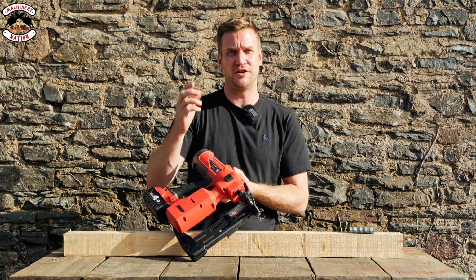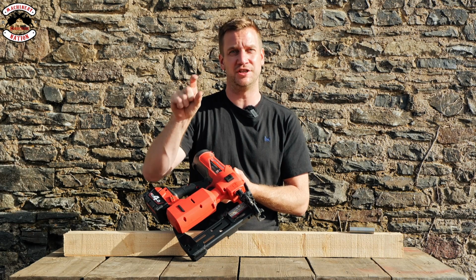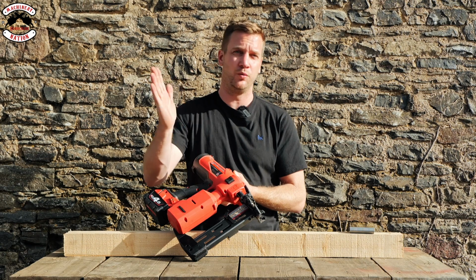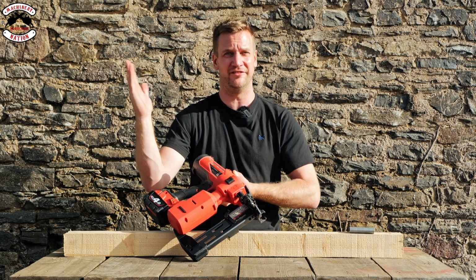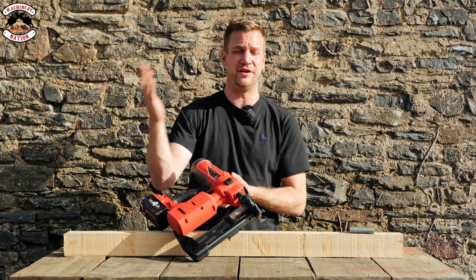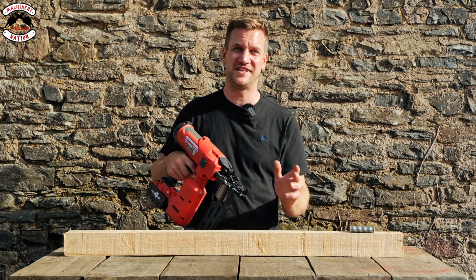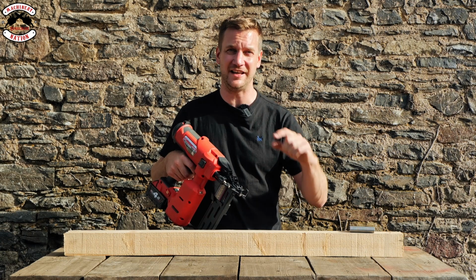When you're fencing, you don't want your staple in tight against your wire. For one, it marks the wire and creates corrosion. And secondly, you want your wire to be able to move in between to allow for flex in the wood. And also so that if you ever want to pull it up a little bit tighter again, you've got that availability.